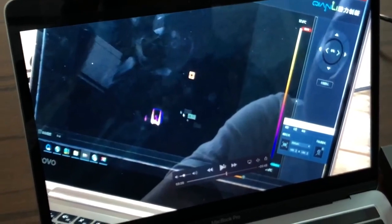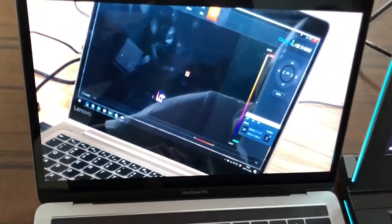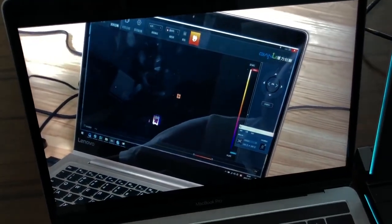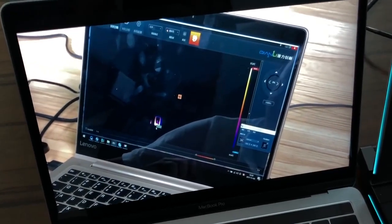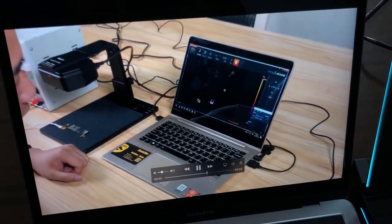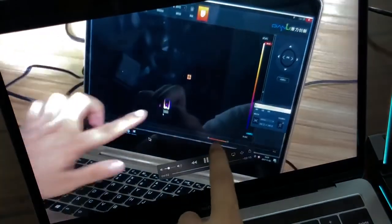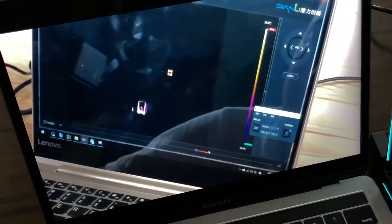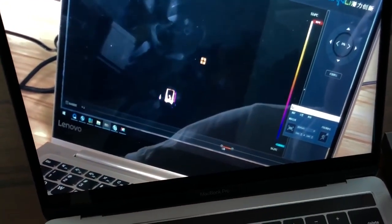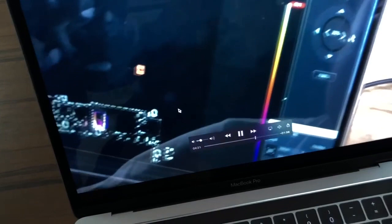So let's keep going. We see a point heating up next to the power chip. Now you can find the hot point from the software, and I'm sure you can also find it by lip or by finger. But a hot chip doesn't necessarily mean this chip is the problem. It may be caused by other circuits around it, such as resistors or small chips. The thermal imager can quickly judge whether there are other hot spots around it, or whether only this one place is hot. So you can adjust the temperature range here to try to find if there are other hot points nearby. The problem might be the small ICs nearby, not this power IC. Other ICs can have the problem that causes this heat issue.